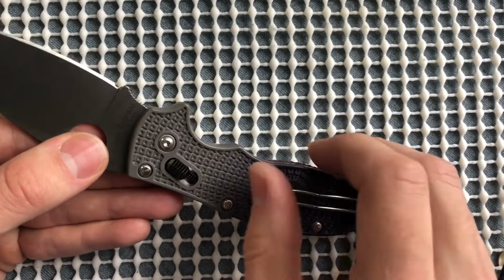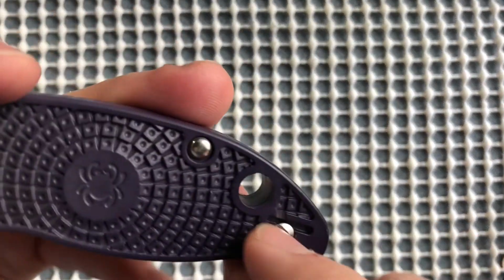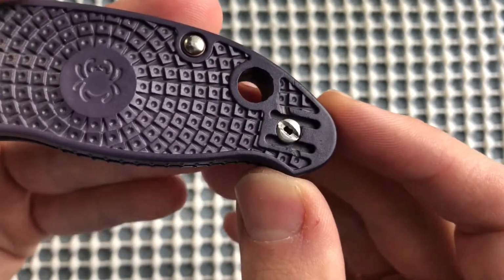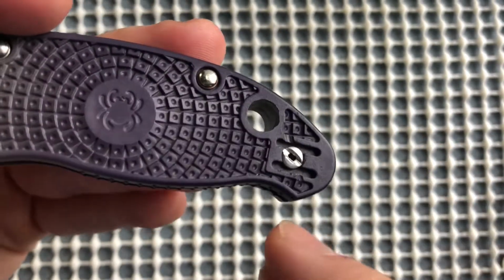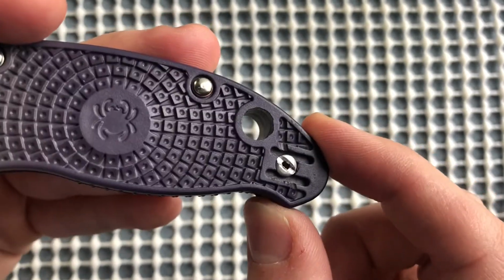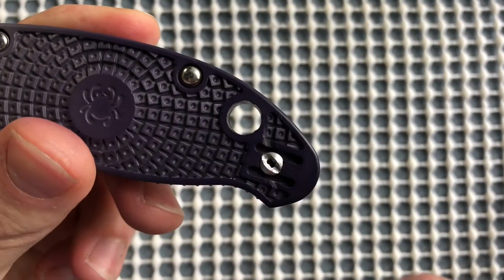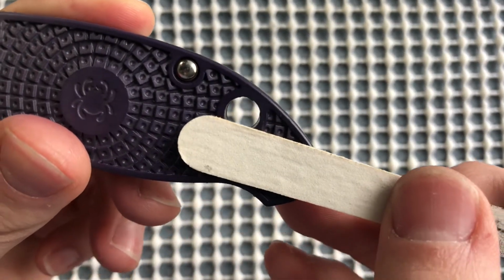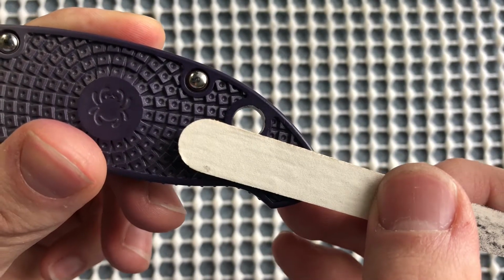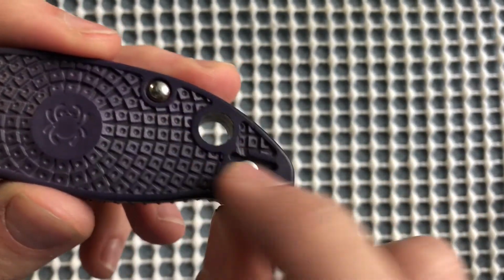I got this clip to be a lot more secure because now I can actually adjust it. And the reason this rivet is now in the position that it's in is because it was originally D-shaped. I wasn't expecting that. See how this hole is circular? Now we take a little flat spot out of it, and that is what we typically refer to as D-shaped, and that's supposed to keep things from moving.